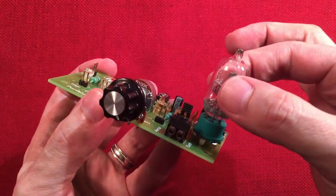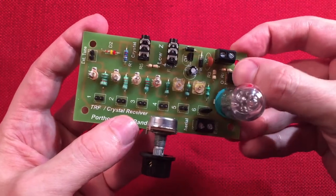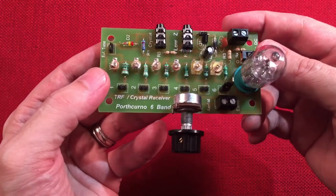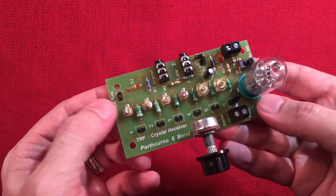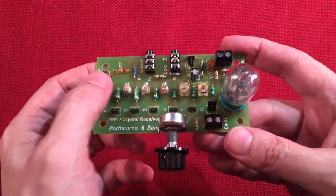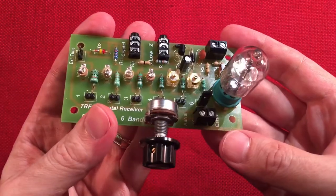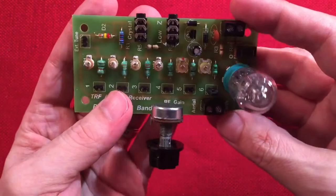This is only needed if you use an outside aerial — it does not need to be installed if you're using it for just indoor use. Here we have the on-off switch when you're using the low-Z headphones, and if you're not, you just leave it off and use the crystal headphones. They recommend band two or three when using the crystal headset. Here's the external tune connector — that's nice they put that there because I think this radio needs a better variable capacitor to tune the first four bands. I was getting a lot of crowding over a couple of these. Here's your antenna gain, and this works really well all the way to the right — you get good volume from the headset.